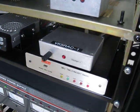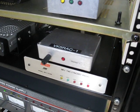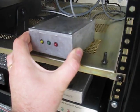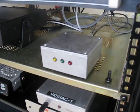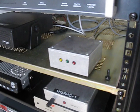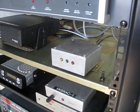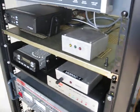It's a fantastic diagnostics tool and I really enjoy the data it provides. Next up in the rack is our repeater controller — a fairly innocuous-looking die-cast box. Inside is a controller designed by Andrew VK5EX. It's a very basic controller that provides Morse identification, DTMF control; you can turn the repeater on and off, change the timeout, change the beep at the end of transmissions.